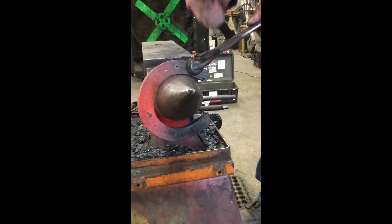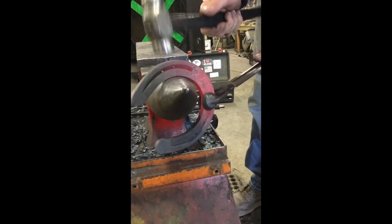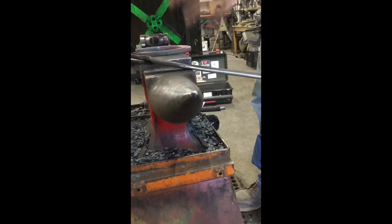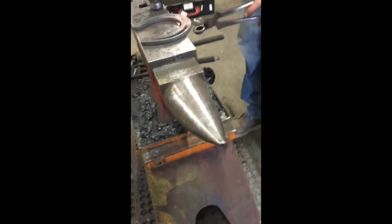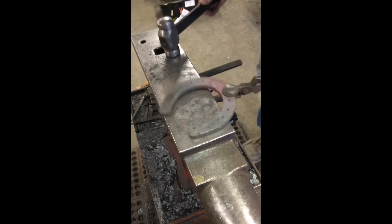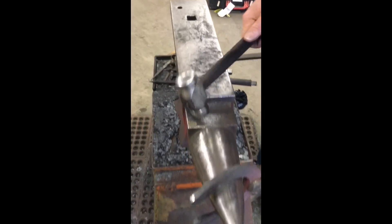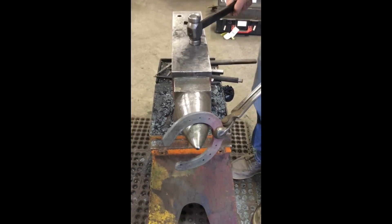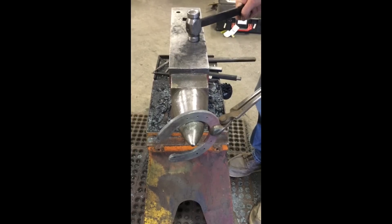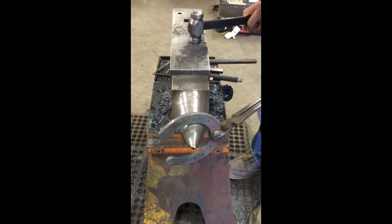Come back from heel nail and go right on through the toe, opening the whole time. Then fix the branch from the heel nail. Now I have a nice open elliptical shape, which makes it way easier to fix the shoe by just closing it up. Open elliptical shapes are easier to make pairs from, and surprisingly, open elliptical shapes are also easier to make the bends fit the horse's foot that you're trying to get it onto.